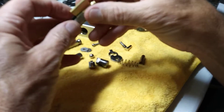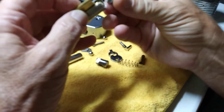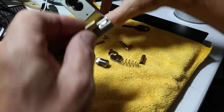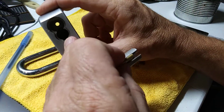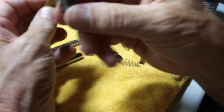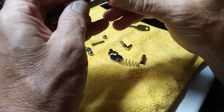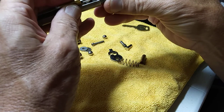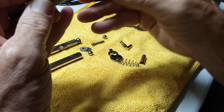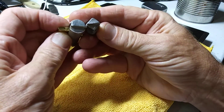What happens is you slide the core in there and make sure that these pieces fit with no binding, so that when it goes into the lock body housing it'll be smooth operation. The actual actuator goes on top of that. I still have some grinding to do because it's not perfectly lined up — see there how it binds — so I still have more grinding and a whole lot more polishing to do.